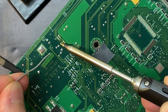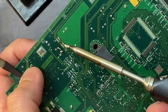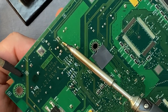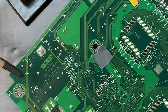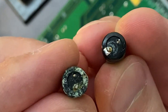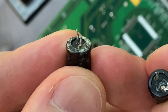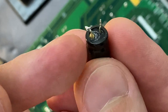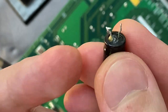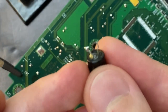Let's plug those two joints. Look at that corrosion. Just to remind you guys, this is the one that I moved from the first Xbox. This one looks a lot more corroded — there's been more leakage. And yet, even this one in the first Xbox managed to damage that one trace that I had to repair, which was causing the power cycle issues where the console would just turn on and off on its own and the power button wasn't working.